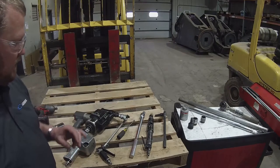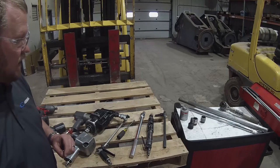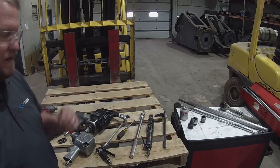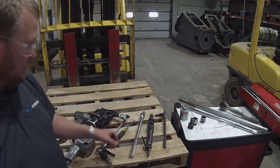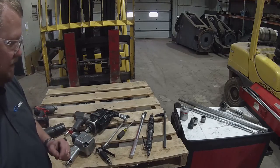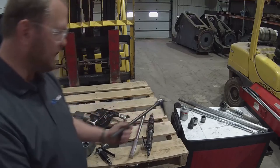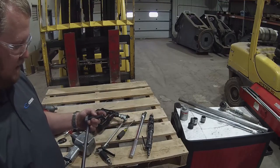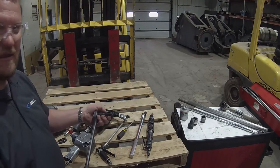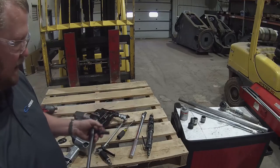It isn't so useful typically with scrap shears, but if you're using demolition attachments where you have a lot of concrete or perhaps some type of mill slag or something that can compact into the bores, these come in handy. You may also want some type of breaker bar, whether it be 3/4-inch, 1-inch drive, or even 1/2-inch drive. They can be useful for a number of different reasons. Some of the flathead bolts also, they all actually have a hex. So if you're having trouble with the bolt rolling in the bolt bore, you can use either a ratchet or a breaker bar with a socket on it.